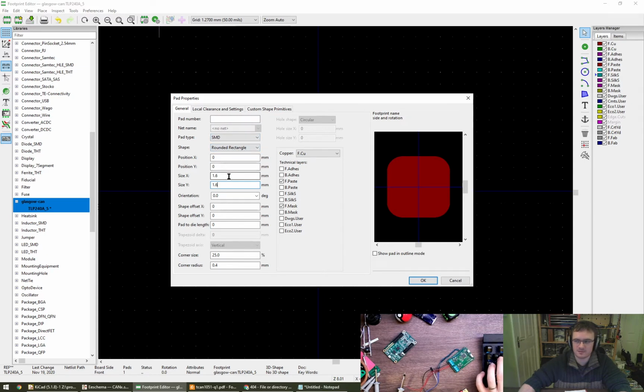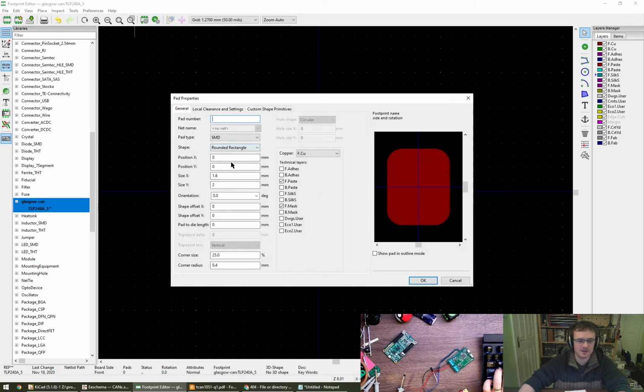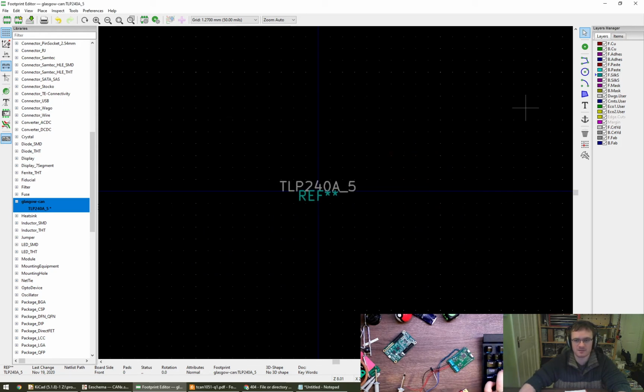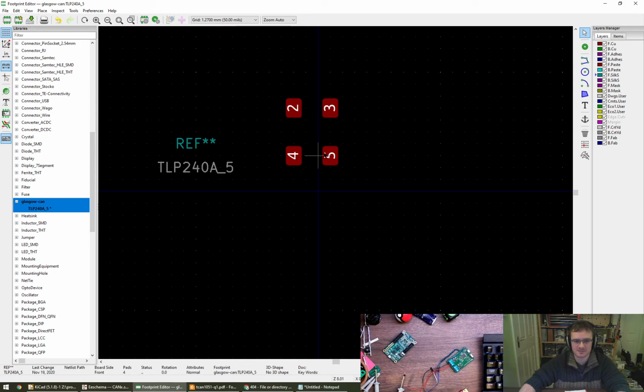Okay. So if I'm going to oversize this a bit, I want them to be a bit taller, so that's in the Y, so 0.7, 1.8, let's say 2 millimeters, shall we? It's a bit high, you want it reducing, okay, let's give that a go. Click, oh look at that, nice. Corner radius is here, corner radius, 0.25 millimeters, right, okay. Right, 1, 2, 3, 4. How does the grid work in terms of like pick and place things? So do I need to put the center of my part on this cross, or can I put an origin somewhere else later?